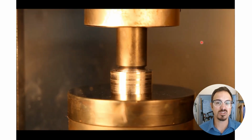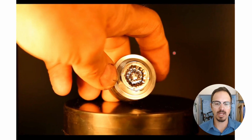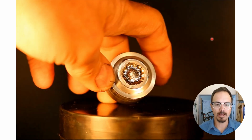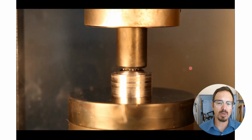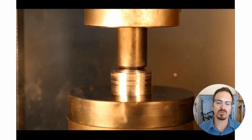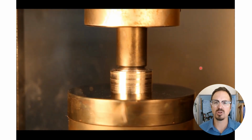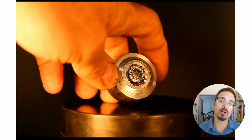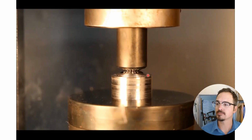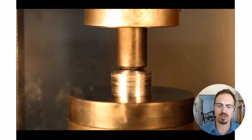steel. This is a really exciting part where we now are creating the negative die. Surface finishes matter here, so this piece of annealed tool steel, we polished it very nicely so that there was no markings on it, and we get a really identical replica of our master hob. So in this case, we use about 65 tons of pressure to hob this die.